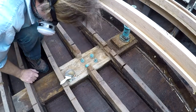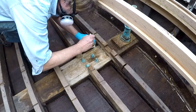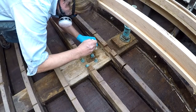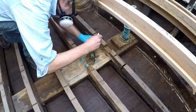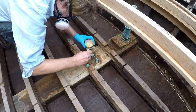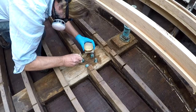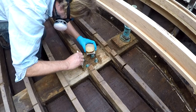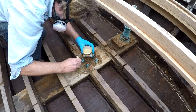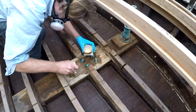So here I am back to work and first things first, I've got to deal with this delignification — this electrolysis corrosion in the wood. Not exactly the dead wood or the keel, it's basically the extension of the dead wood aft of where the cut-out for the propeller is. So where I'm applying this epoxy right now, that piece of timber — the centre one anyway — is only about 6 inches deep and then I'm into ocean.